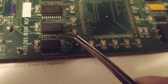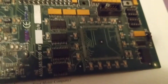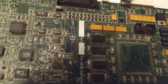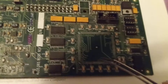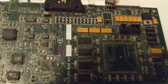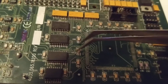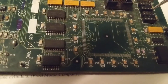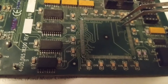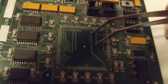These are the pads, and these are the pins making connection to the pads. The problem is vibration — including in your instrument cluster, which is the one with the gauges on your dashboard. When I had the responsibility of repairing those, there are many chips and a microprocessor. The microprocessor is the big one — this whole module is not called the microprocessor; the microprocessor is just the biggest chip. These chips tend to come off due to vibration and heat. This shock absorber tries to absorb the shock, but it cannot absorb the shock of a vehicle jumping up and down at 80 miles an hour.